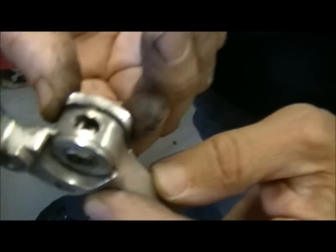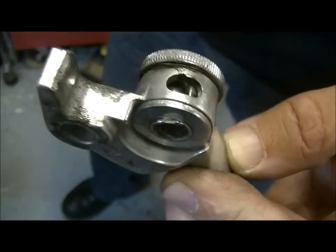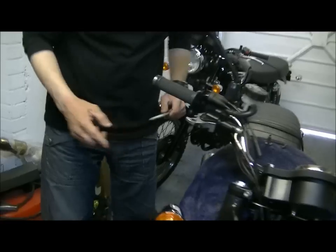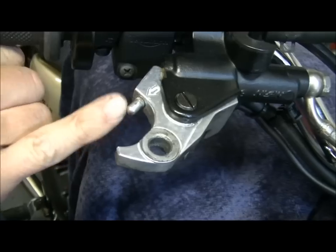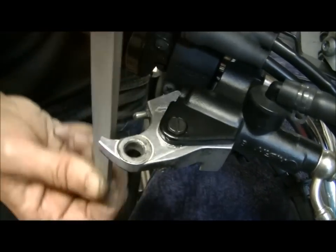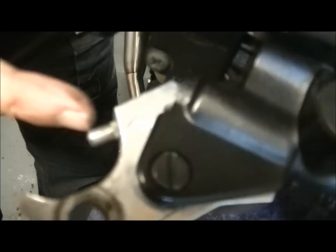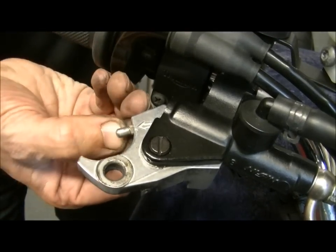You can see in there — here's the little cam. That's number one, very shallow; two, getting deeper; three and four — that's the deepest one and that's the one Penny's using but it still isn't low enough. So, common sense — pay for thinking. This little post is what the cam bears against. The difference between one and four in the depth of those holes in the cam is about two or three mil. So don't go getting a grinder on the end of that — all you need is a file. I'm going to file that flat. If you look at the amount of curvature in the end of that, there's an ellipse on the end, about a three mil ellipse. I'm going to file that flat completely until it's like a flat peg rather than an ellipse, and that will have taken three mil off it.